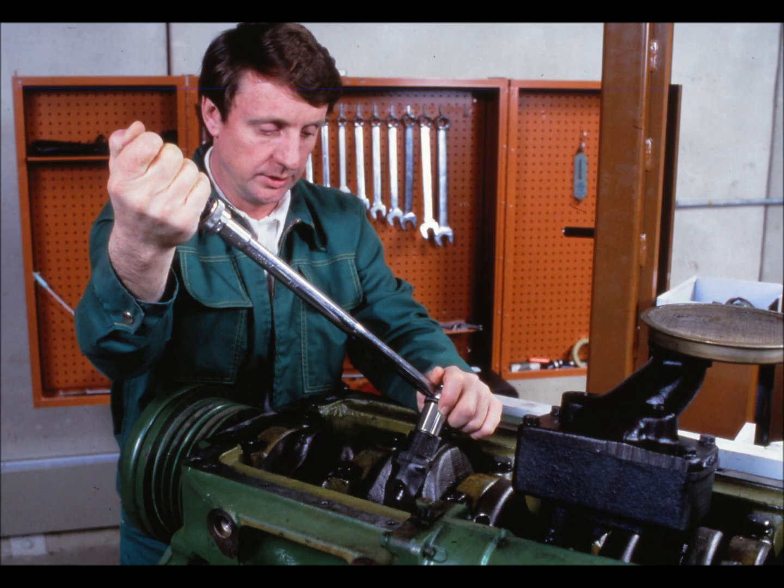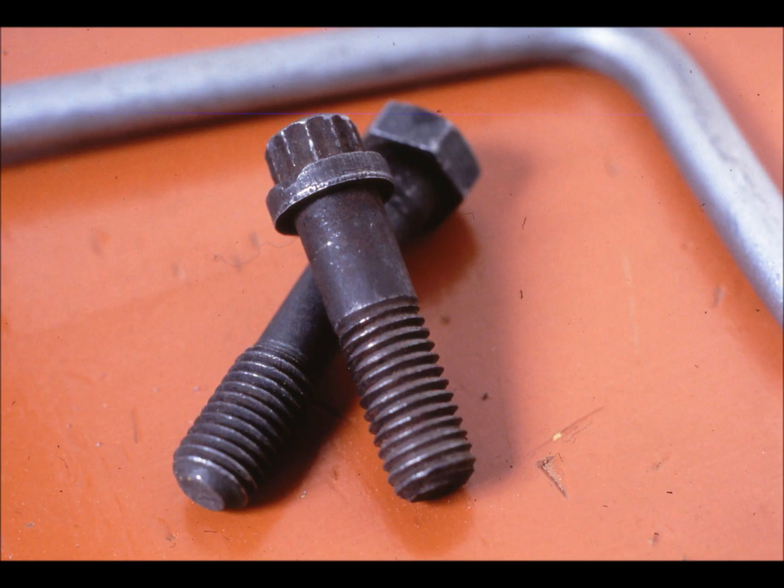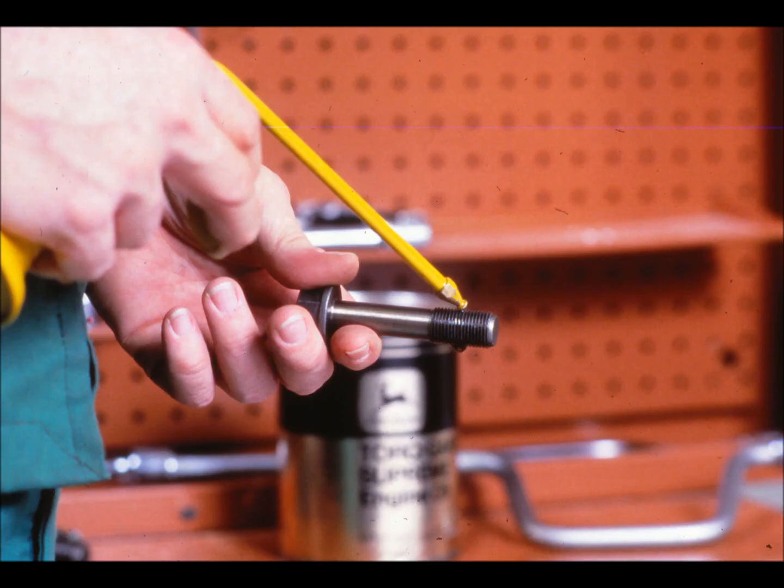But since torque is an indirect measure, there can be some problems in using it. For example, what if there is dirt or debris on the threads when you install the fastener? That debris increases the friction between the two inclined planes formed by the threads. That extra friction increases the effort needed to slide them past each other — in other words, to tighten the fastener — and throws off the relationship between torque and tension. As an extreme example, if you try to tighten the cap screw with rusty or dirty threads, you could reach the specified torque level before the parts being held together even began to touch. That's why you should always make sure the threads are clean and well lubricated according to technical manual instructions before installing any fasteners. If the technical manual doesn't call for a specific lubricant, use regular engine oil.